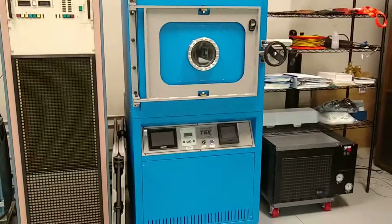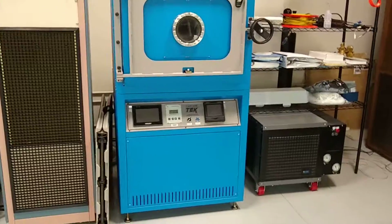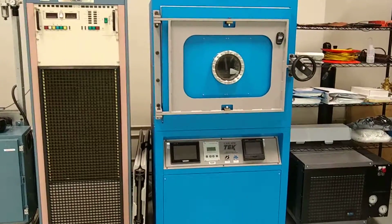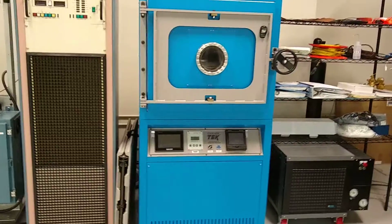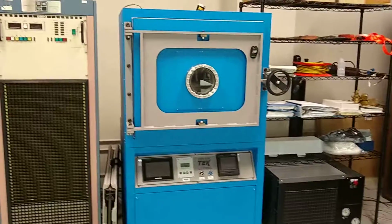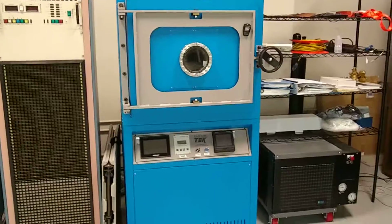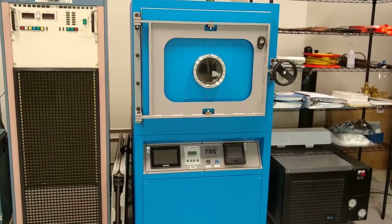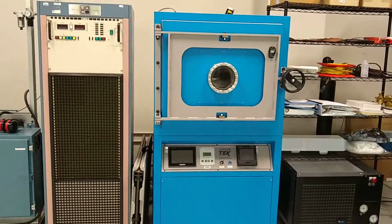Again, the air pressure is also important, that we simulate the reduction of the air pressure, because on every satellite you have also things like cables. And cables have softeners, and these softeners will simply evaporate out of the cable primarily onto your detector, because that's the unit that is usually cooled on your satellite. It's like you take a can of soda out of your fridge and put it on the table, and you see the condensation outside of the can. Well, we see the same thing with the satellite.